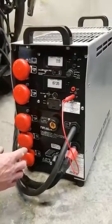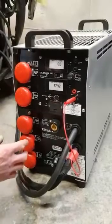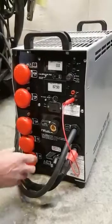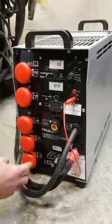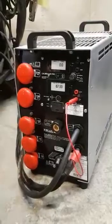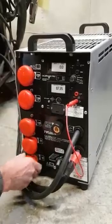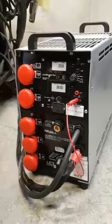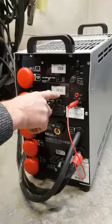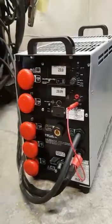You can apply any of these loads at any point. You should try to select the one closest to the output that the power source is set to — so if you've got your power source set to 30 or 40 amps, then go with a low setting to start with. These values are just approximate and you can add as many as you want. If you start off with a 30 amp load setting, you see the volts has come down to an on-load voltage and the current has gone up to 23.8.